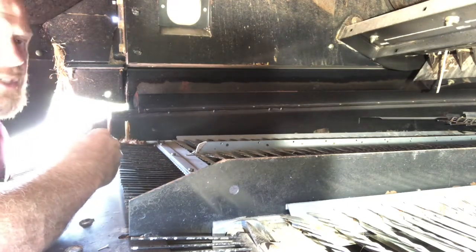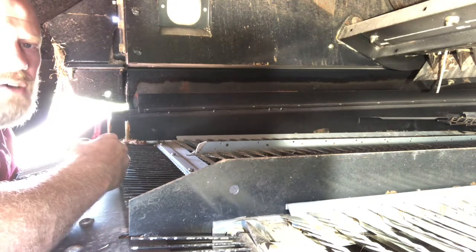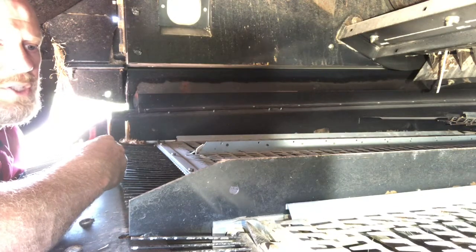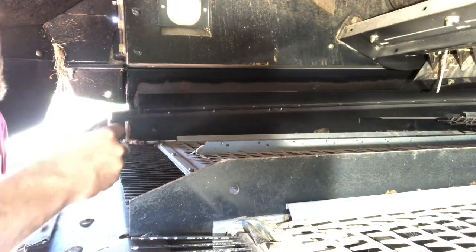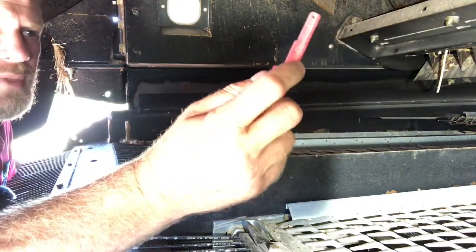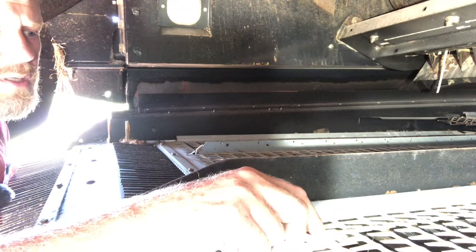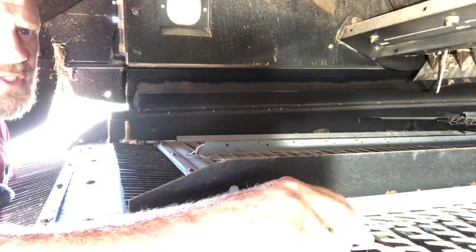I've got my thumb switches on the side over here. If the key is off on the machine, on these 30 series and newer machines, you just hold the button until the controllers wake up. So I've closed it all the way down, I'm going to take my 6mm step right here, hold my finger on it, and then I'm just going to sit here and bump it to open my sieves up.